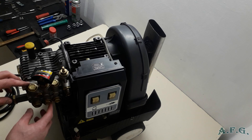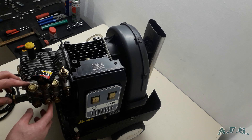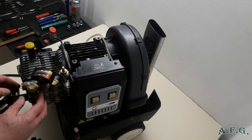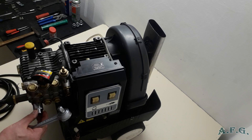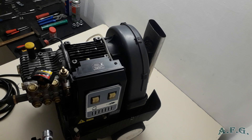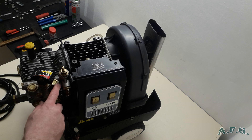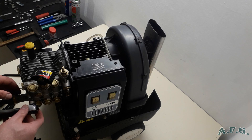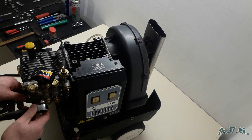As you can see it's a massive pump with brass screws. Whenever you need to change the inlet valves, I think it's actually better to do it while the pump is still installed — it's easier. If you use a reversible ratchet with a size 22, and the pump hasn't been serviced for a long time, you can apply a little WD-40 on the brass screws to make it go even easier. I'll just remove these eight screws so you can see how the pump looks.